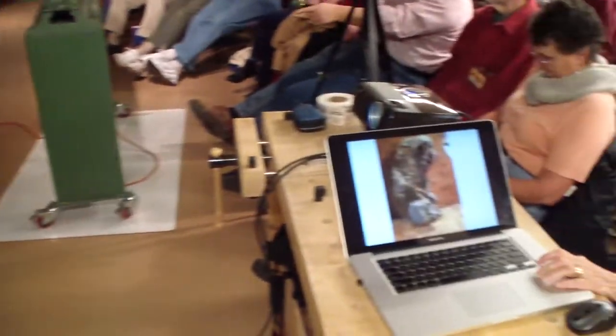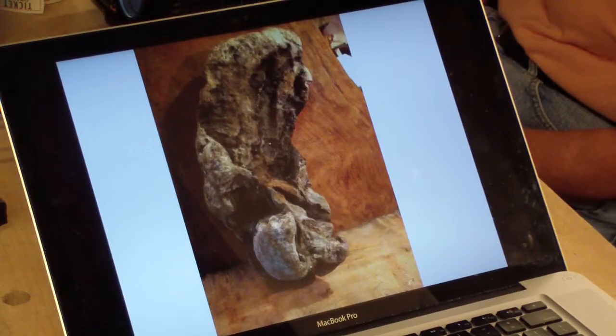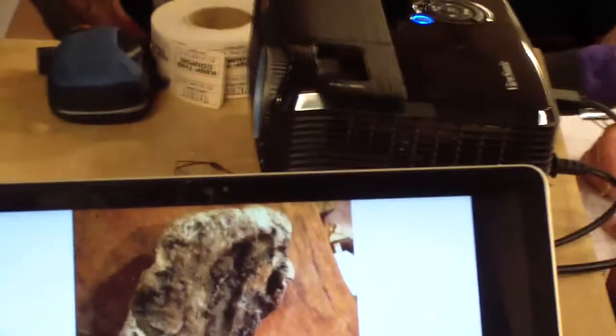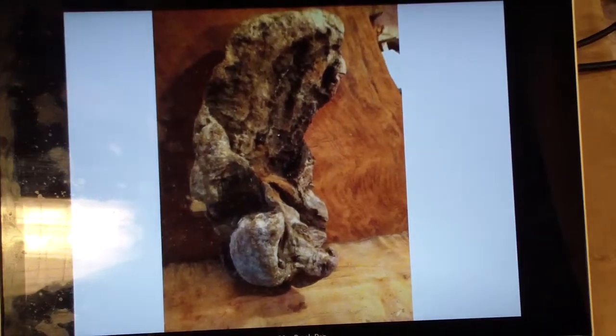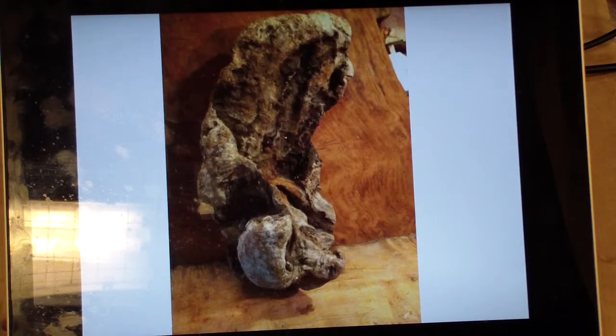You say you turned that piece of wood? It was done on the lathe. So it was mounted on the lathe. There's a tenon turned down here that goes into the mulberry piece, and the hole was drilled on the lathe. After the tenon was turned, it was put in a chuck so I could put a drill bit in the tailstock. Nothing else was on the lathe.